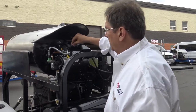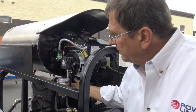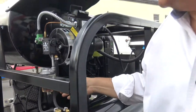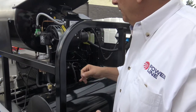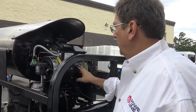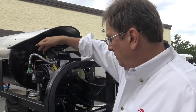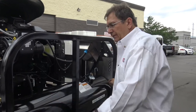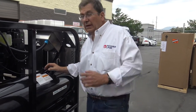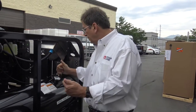Okay, the little burner unit's back here. I say little, your 500,000 BTU. There's that filter right here. Diesel gets dirty, so I always like to keep running fresh diesel. Fuel pump, igniter, motor right there. On and off solenoid. Got a great big fuel tank. Love that. Get fuel on sale. The other thing I love is your single source fuel, diesel. Don't put gas in this, please.